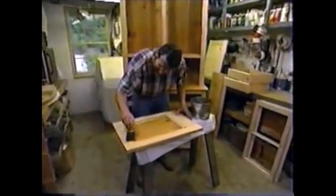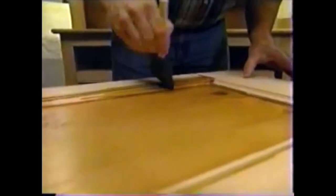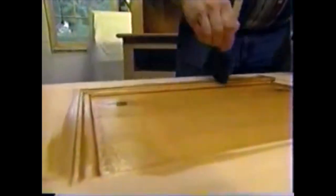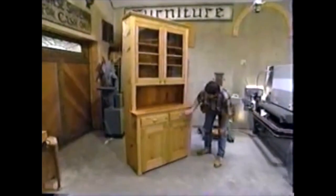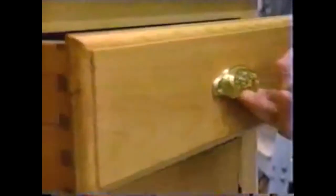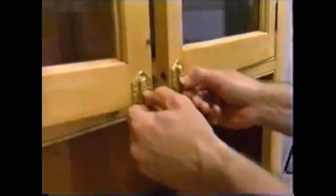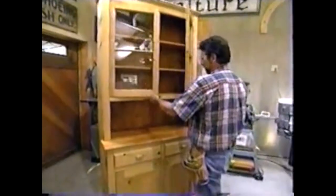For the finish on our old pine hutch, I'm using a stained polyurethane combination — the color is pecan. I'll put on one even coat, let it dry for about eight hours, hit it with some steel wool, and then put on a second coat. That'll be enough to protect the piece, but if I want it darker I can add additional coats. With two coats of stained polyurethane it's just the color I want. For hardware, I'm using old-fashioned spring latches — they hold the doors securely closed and act as a pull to open them. On the drawer fronts, matching brass pulls, and the same type of spring-loaded latch on the glass doors. The glass is installed, all the shelves are in place — this was a good project with plenty of room for storage.